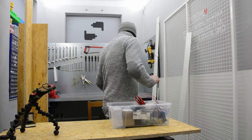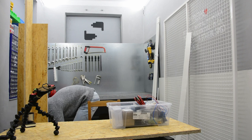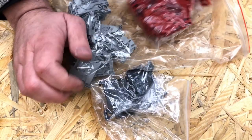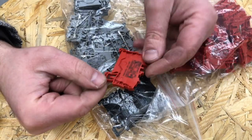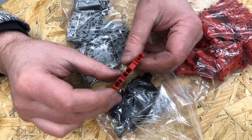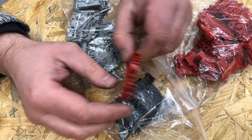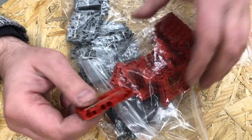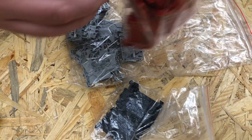And for the terminals, I'm using these beautiful Wago terminals. This is from the 2002 product line, and they are push-in type terminals, so I don't have to fiddle with screws and everything, and they can stack nicely on the DIN holder. And I have a very positive experience with this one. So I have like 60 of them. That's how many connections the logic needs.